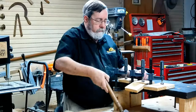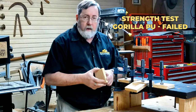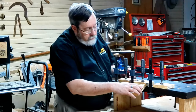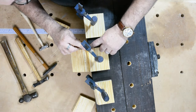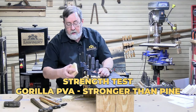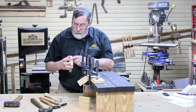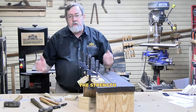Looking at the failures: on the Gorilla Glue, it's clearly the wood that failed. In a first test run off camera using the same blocks, it was actually the glue that failed — but this time the wood itself broke. The Titebond is still partially together, but it's very clear the wood broke — I can see the glue line, and the break is offset from it by about 3/16 of an inch on one end and 1/16 of an inch on the other. For the Gorilla, the glue line is all the way down here and the wood broke up above it. In all three cases, the glue itself was stronger than the wood. For both PVA glues, it was clearly the wood that failed.